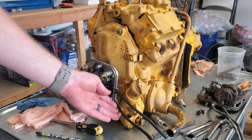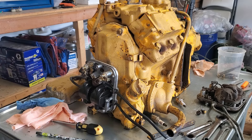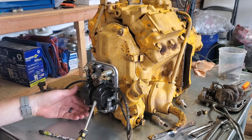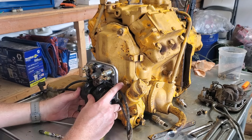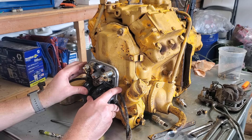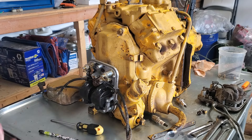In case you didn't know that or need to figure it out, that might be helpful. With all four of those screws installed, we just rotate this all the way forward clockwise as far as it'll go. The rest of it has to be done while it's on the tractor, or at least when it's hooked up to a six-volt battery. So that'll be the next step.